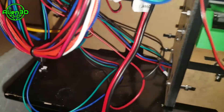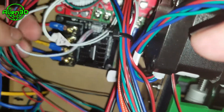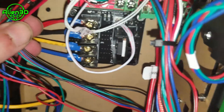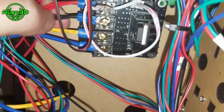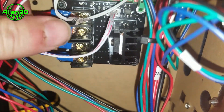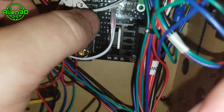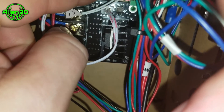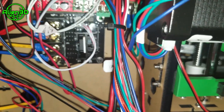The third thing I suggest, besides the wires and the power cord: these two wires here come directly from the PSU, and then these wires here go to the bed. It's got two red wires and two black wires coming from the same hookup. This is the signal wire that normally your power wires go to for the hotbed, but instead you put the signal wire in here, and that will manage the power for your hotbed and keeps the current out of the motherboard.